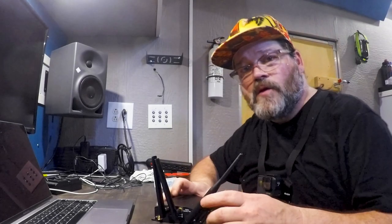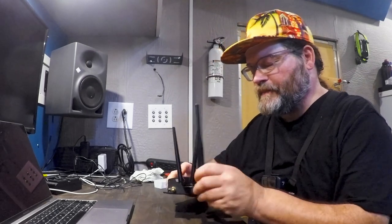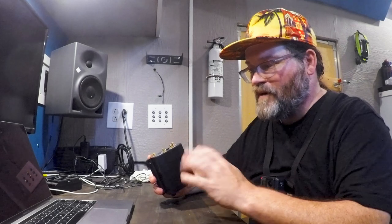And that's it. I may come up and put another bead or two around it once that dries. The router I'm using is this PepWave Max BR1 Mini — it comes with these antennas, but these weren't doing the job inside this metal box. All I need to do is unscrew these. You'll notice once I get these hooked up I have a few extra leads to that antenna, because I have a feeling I may need to go up to a better modem router. The newer ones, instead of having two LTE antennas, have four, and instead of one Wi-Fi antenna, they have two. That's just future-proofing — I can switch out the box and not have to worry about replacing the antenna if I go to, like, a Cat 18 modem.